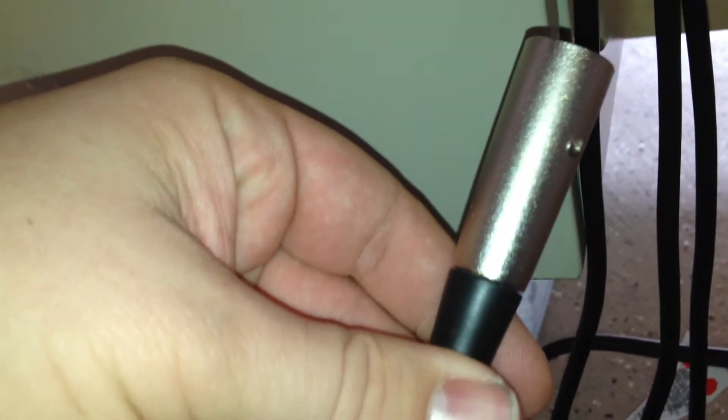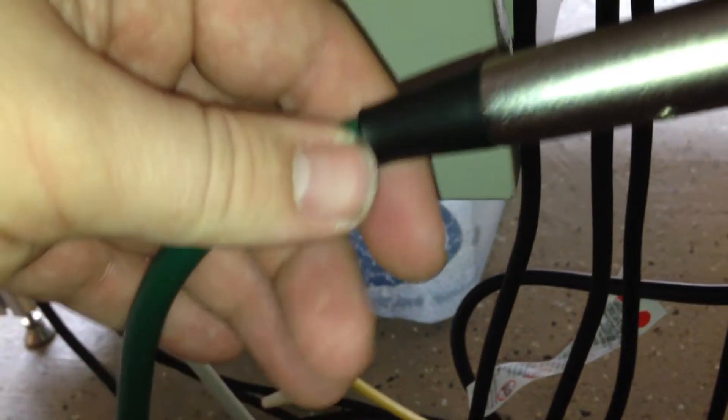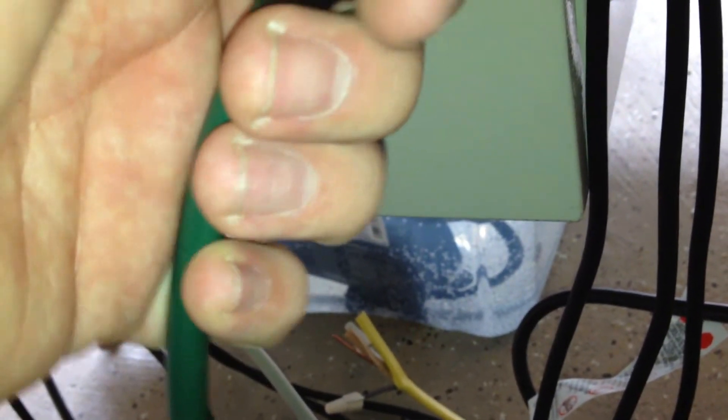The other thing I got done today was this plug. This is a five-conductor XLR connector — the same kind of cable as that gray cable. It's rated for continuous flex. I didn't think I really needed that, but it's shielded as well. It's grounded to the outside and grounded to that connector in the back. This cable will be the signal-carrying cable to the VFD, which will get mounted up there.